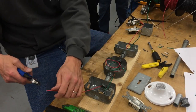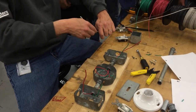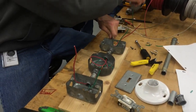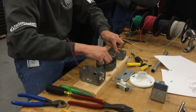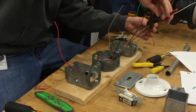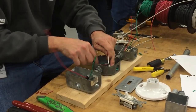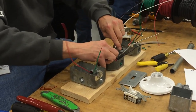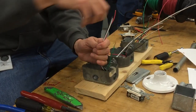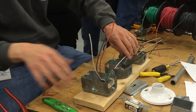Make sure you've got your six inches still on either side. So now the red one's done, and I just need a white and a black to go from each side over. And that's it — the rough-in's done. So now I've got all my wires ready for rough-in.